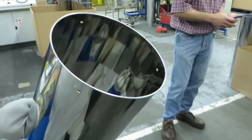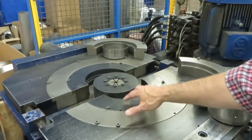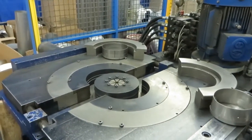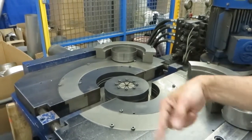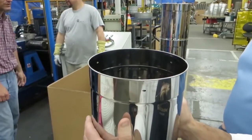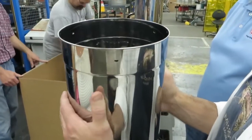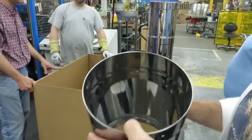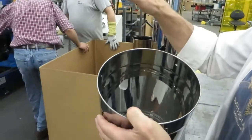That's what's critical. The reason why a lot of people don't do this is the tooling for these machines is very expensive — the amount of tooling we have is probably double the price of the machine. You have four pipes fitting together every time you put a male and female together, so if you have any inconsistencies there, you've got trouble. That's why you have to have inner-outer tooling for end forming.